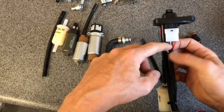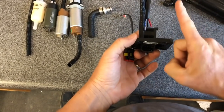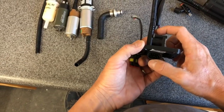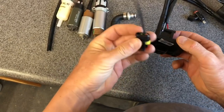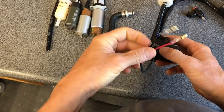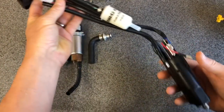The only two we care about if we're trying to determine if the pump is going to run or not are the red and the black. Orienting it at your bike — front here, back there — you've got three pins. The far right is your pump motor positive, 12 volts to the pump. The middle one is ground. The blue light reference we don't care about is the far left. With this connector, red at right and black in the middle, you plug in, send 12 volts, and you'll hear the pump run — or it won't. That is a pass-or-fail test.